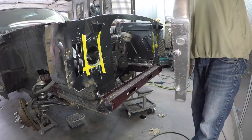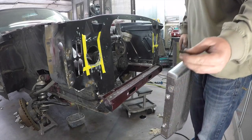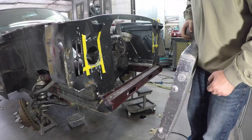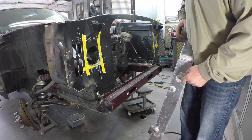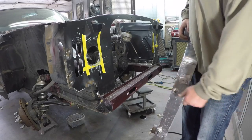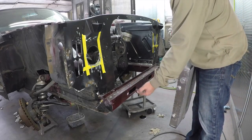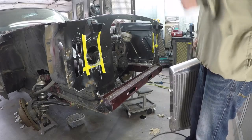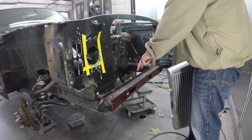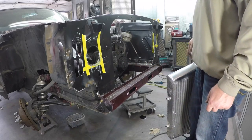At the first part of this segment, we were cutting these bolts off to make some studs to be able to register in these holes that are already drilled. And you see the original hole locations were there and there, and when we originally mounted this, we had them moved, and that was before I had a TIG welder, so I had my friend James weld those up so that we could use these access holes here to get a bolt in from the underside. Well, now that we got the holes in the locations we want, we kind of had to reverse the process, and since these were already a registration point, now we got to fit these up.